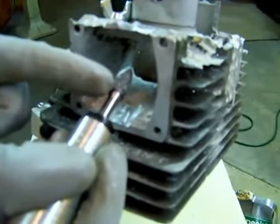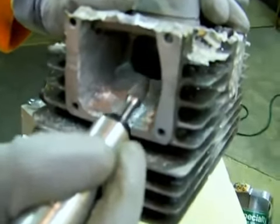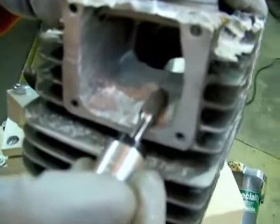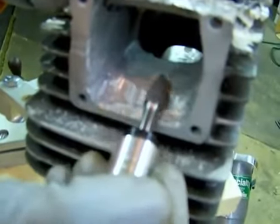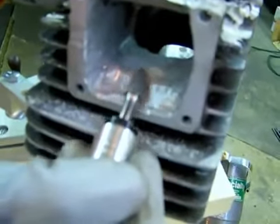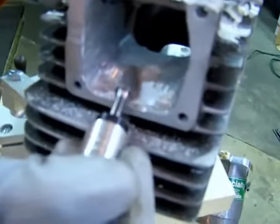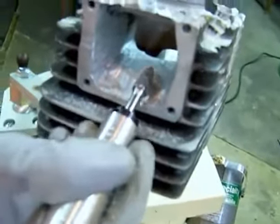As you can tell, most carbide burrs are right-hand cut. So you'll actually do more cutting on the metal surface when you're coming against it in this nature. Now when you're going back the other way, you're still doing cutting, but not as much. I like to keep the carbide burr moving. It's a lot easier to smooth out that way and get better results.